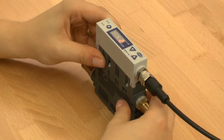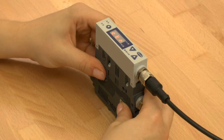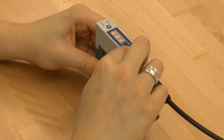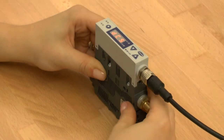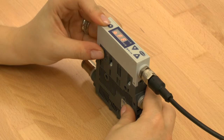Press and hold the menu button for three seconds to go to the configuration menu. In this menu you can turn on the air saving regulation with leakage monitoring function. By pressing the up or down button you can choose between the single functions. If you choose the function DCS off, the ejector goes into the operation mode permanent suction if the leakage value and the switching frequency of the valve is too high.